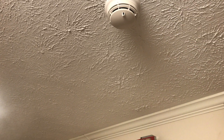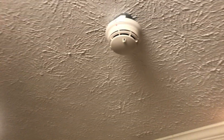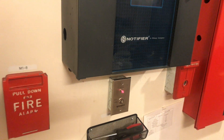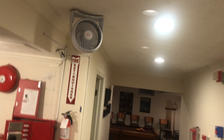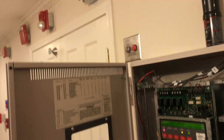To end this test — please don't fall in there — we are going to Saber smoke test the Simplex smoke detector. There we go, there's my Saber. It should be enough — enjoy my dog running around upstairs. I have the panel in silence and the smoke fan going to blow out the smoke detector, and that is running through my Notifier panel.